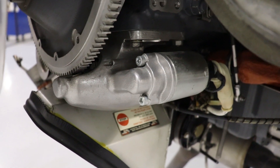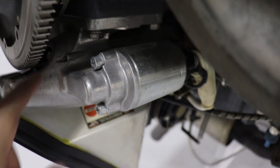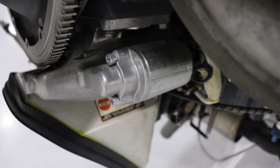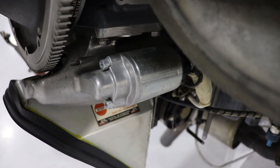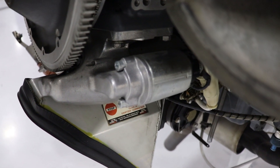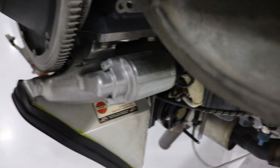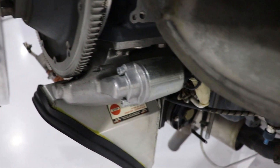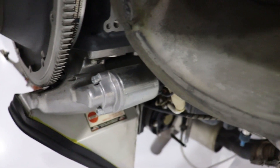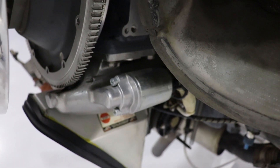This part is going to be our starter motor. Inside this housing, there's a small wheel with some teeth on it that will pop out and engage with those larger teeth of the prop. Whenever you turn the key to engage the starter, that's what's going to get that prop actually spinning. Once you let go of the key, that part will move back and disengage the starter. This is also why it's really important that if you happen to let go and disengage the starter, don't turn that key again until the prop is completely stopped — otherwise you'll hear a grinding noise as the small wheel engages with the bigger wheel that's spinning much faster.